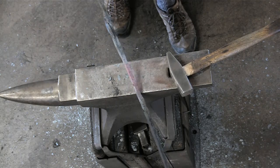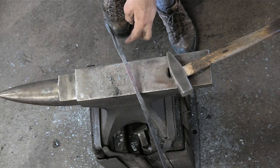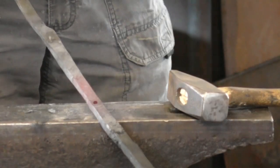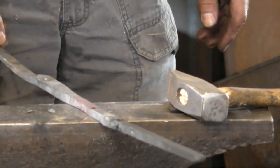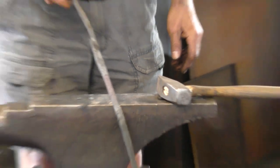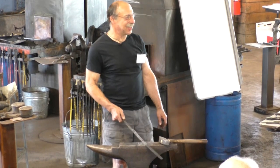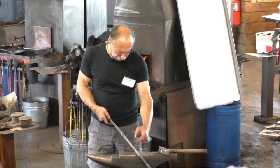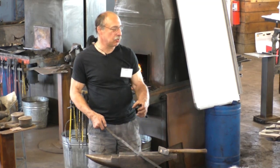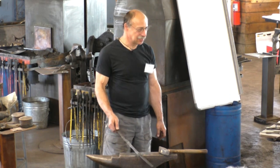That's why we measure on the center line, because the center line doesn't change when you bend it. What would you mark on the surface? No, I use the center line measure. When it's flat, the center line is the same as the edge. Well, that's the most likely, but no, all this area between my reference and the hole is hot. It's going to shrink when it cools. Oh yeah, yeah, yeah.